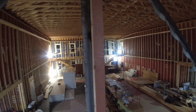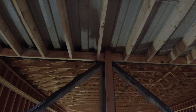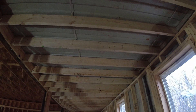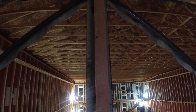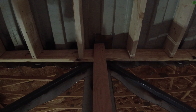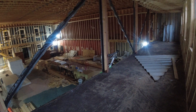The third thing that I've done is to put these four by four beams here. The main purpose is actually to hang the two by six up there. The two by six is used to hang these other two by sixes so that we can put spray foam up there and hang drywall, but also it actually provides vertical support. I've shimmed up the top of the four by four with metal pieces. So structurally, because of the three things that I've done, it works — it really provides the kind of structural rigidity that I want.